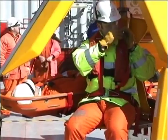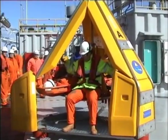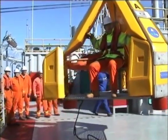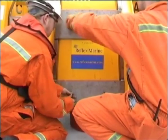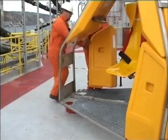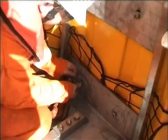The unique design of the FROG allows it to convert to a marine ambulance mode, enabling the safe transfer of sick or injured personnel by stretcher fitted securely within the capsule. Prior to changing the unit to stretcher mode, consult your client technical manual and follow the instructions found on the inside of the unit. Firstly, remove the two designated buoyancy panels — clearly marked B and C — by removing the bolts. These two panels can now be fitted to the outside of the unit using the handles in the sides, allowing plenty of room for the stretcher.